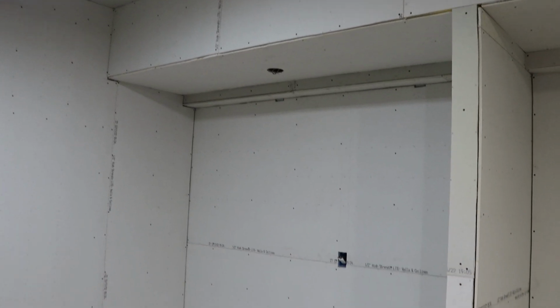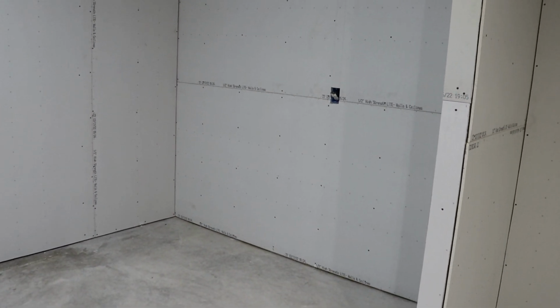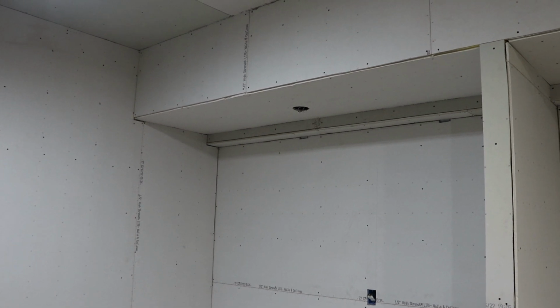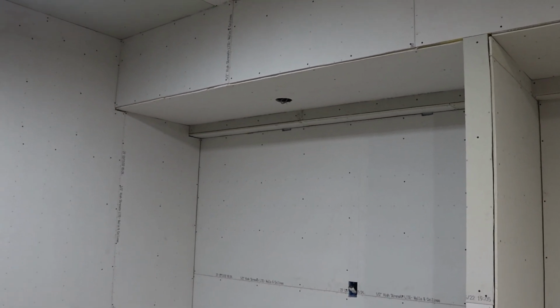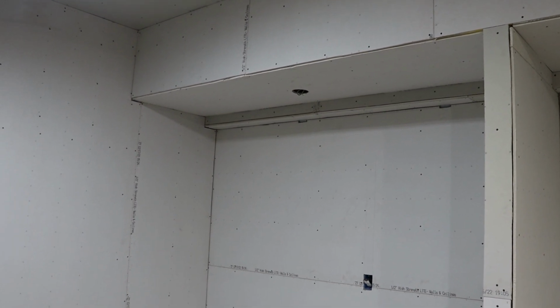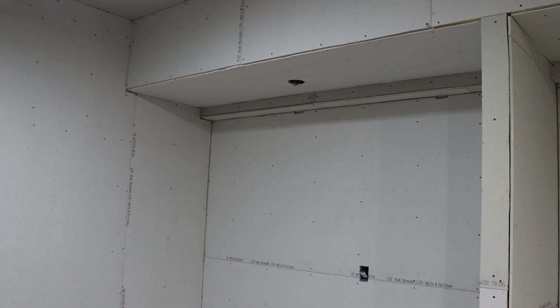You remember from the last video, I got all the drywall hung in this little cubby. What I'm going to be doing is finishing the drywall, which means adding the metal edges to the corners, adding tape, and then putting the top bond over it, so it'll just be a flat wall that can be primed and painted. I'm going to focus on this little cubby because it's going to show outside corners, the metal edging, and inside corners, and of course vertical joints and horizontal joints.